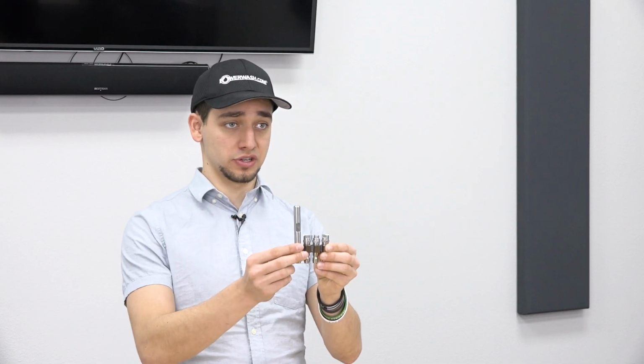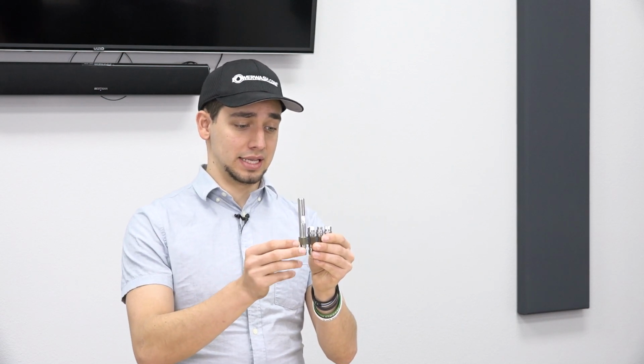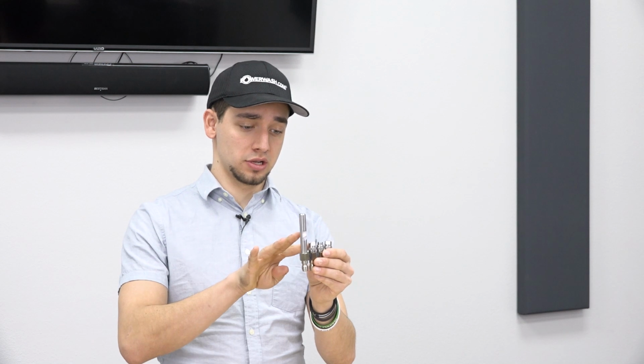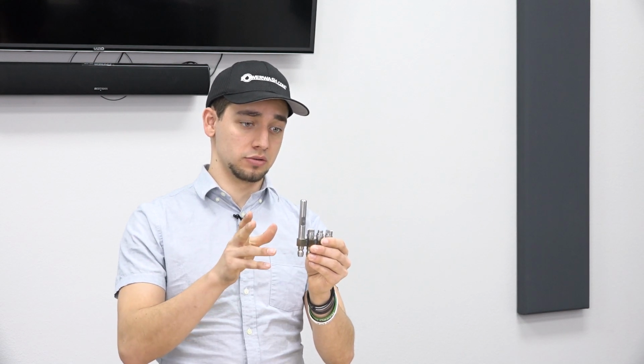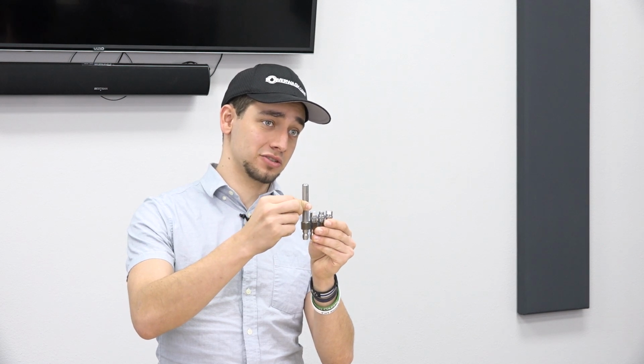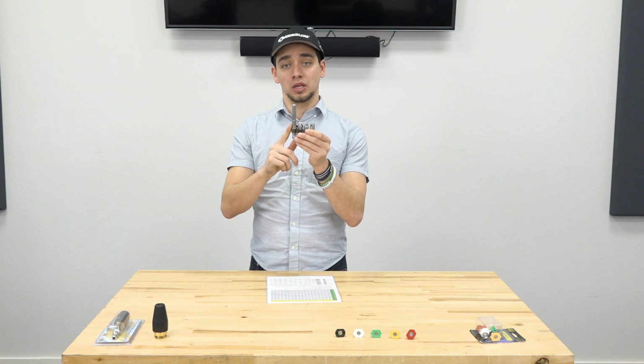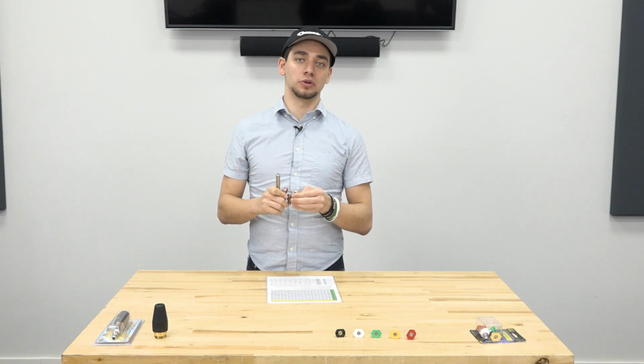This one here is for a 7 to 8 gallon a minute machine. It's got 4 different nozzles on here, with their different uses and meanings. The long one is called an assassin nozzle. When you're pulling soap, it allows the soap to shoot much higher and much further, so you don't have to get on the roofs when you're house washing.